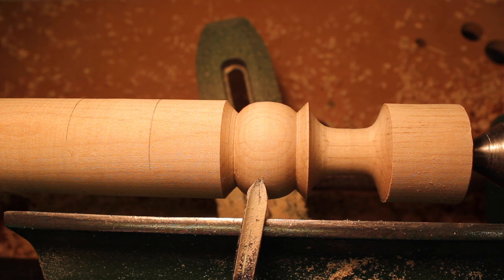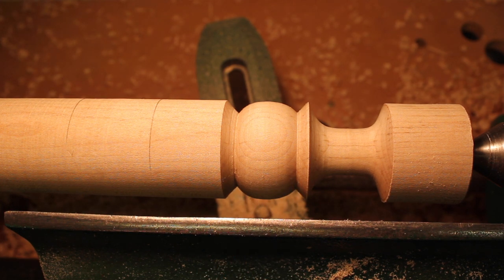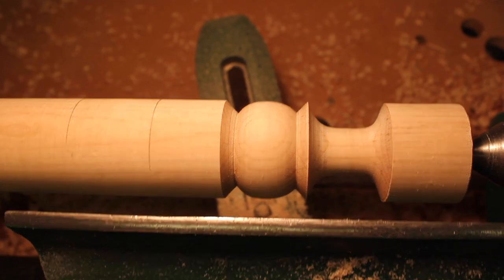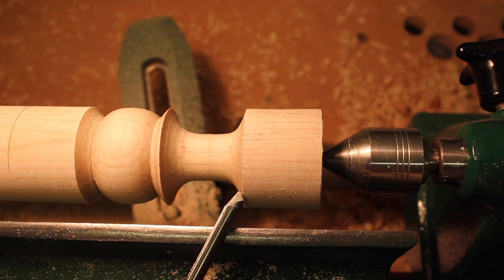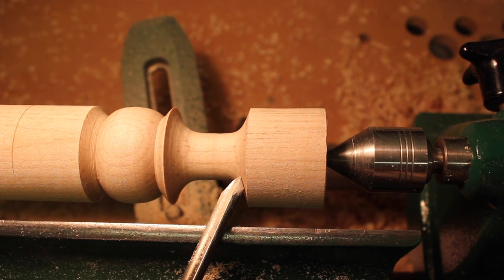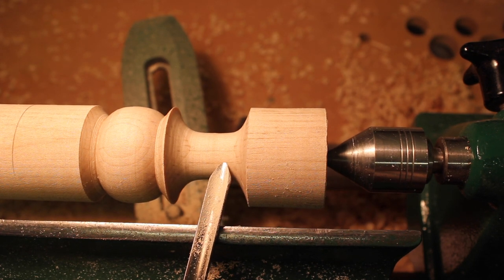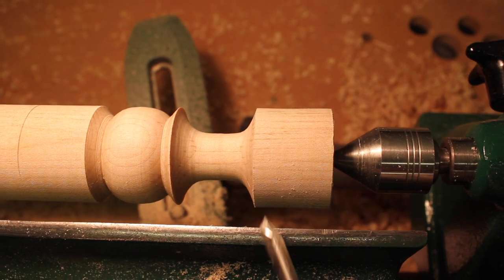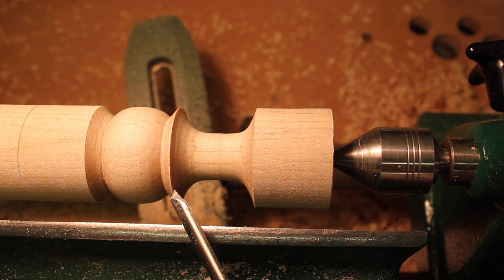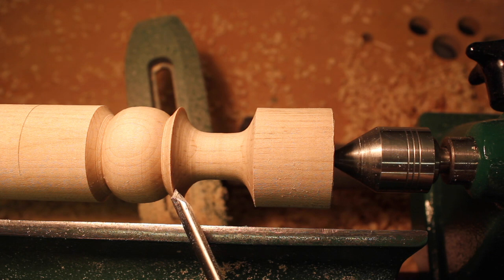And consequently the same the other way. So you've got the bevel rubbing all the time as it's following the curve that you're trying to achieve. And it's the same with the cove. On the right hand side, bevel rubbing, twisting as we come into this shapely corner, and ending up with the flute upright in the centre.